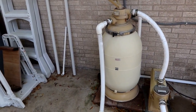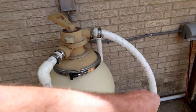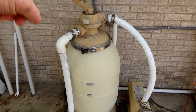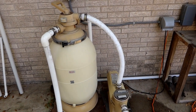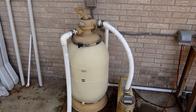We're going to go back today and figure out what's going on. Since I was there last time, which was yesterday, I have shocked the pool again, which is something they requested I do. I have also backwashed the filter. As you recall, last week we replaced the sand in the filter housing. The sand goes up to about here in the filter housing. The water comes in from the pump, goes down to the bottom, which filters out all the solid waste, and then it's recirculated back into the pool. The sand captures any contamination, anything in the water that's not water, and holds it on the top of the sand layer as it filters through.